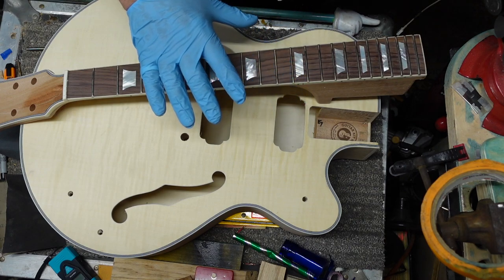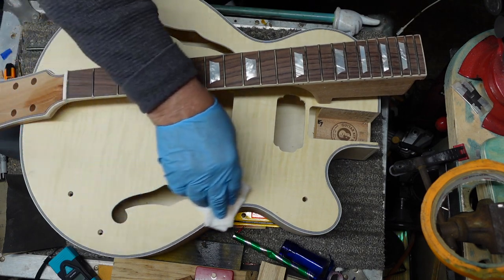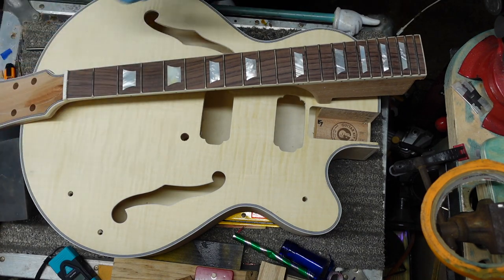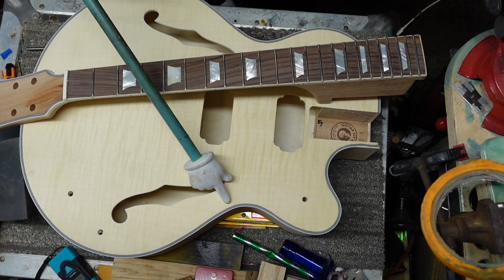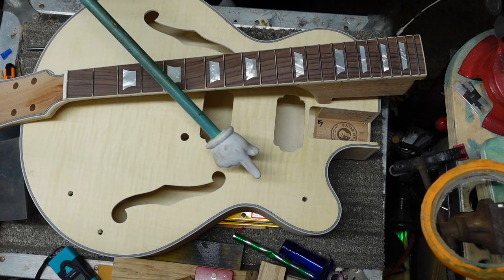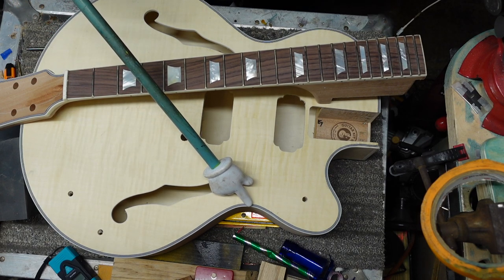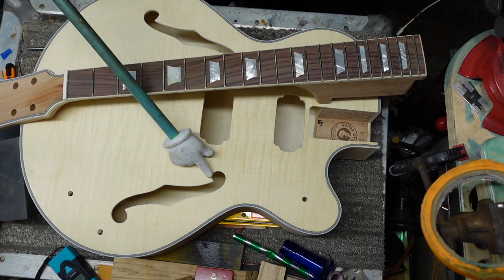So I'm going to wipe this whole thing down, pay attention to the spots we got. Then I'm going to come along and sand it, the whole thing. And then when I'm done sanding, I'm going to make sure that the wipe all rag doesn't pick up anything. I'm going to sand the top to the bridge I'm going to use. And then, and only then, am I ready for finish again after I've touched up these holes here. You want to remember this kit has purfling here. I'm going to stain this, so I don't want this to get messed up. Guys, never use acetone to clean your guitars, the ones that have binding and purfling, because you'll melt that stuff and deform it. This one has white binding around the F hole and stuff, so pay attention to that.